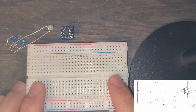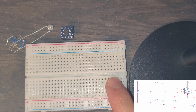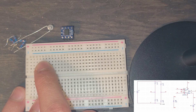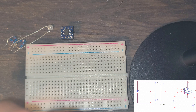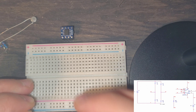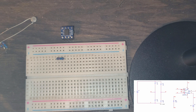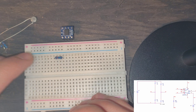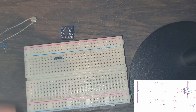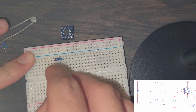Getting started — we have our breadboard. Let's plant the resistors first. We know we're going to have some voltage coming into two resistors that are essentially in parallel with each other: R1 and R3. These are both 10k, so we're going to put them in the same column. They need to terminate in different columns, so this one goes here and this one goes across the breadboard.